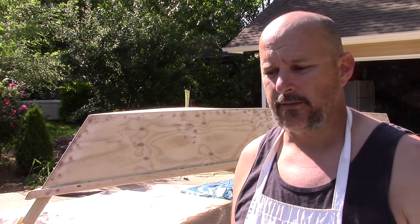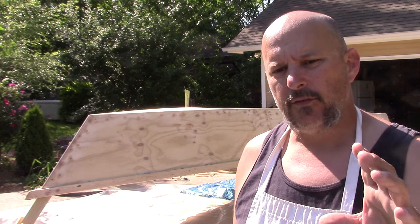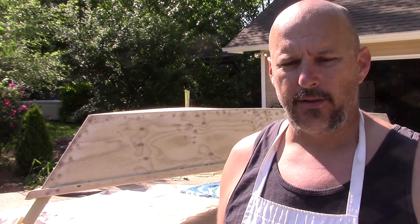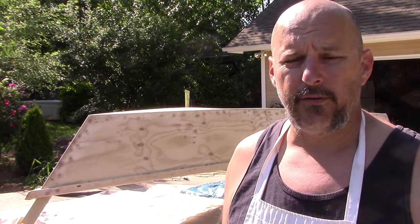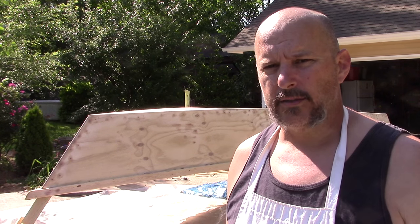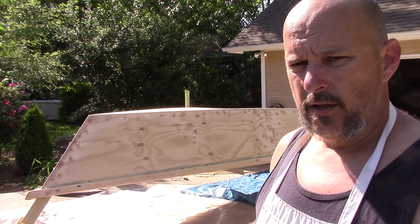Each of these processes I'm going to do with the least amount of epoxy I can get away with, because I've learned over the years that anything you put on to try to fill the weave while doing it the first time isn't going to work. I put on just enough epoxy to saturate the glass and make sure it holds. Then I go back and fair it — it's the fairing part, using micro balloons or fairing compound or wood filler, that actually fills the weave. That's when you use your epoxy mixed with fairing compound to smooth the whole boat out.